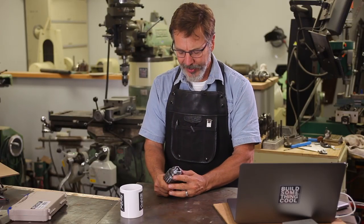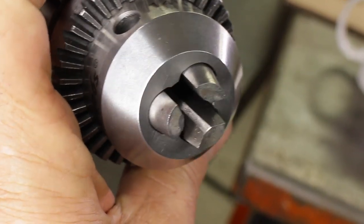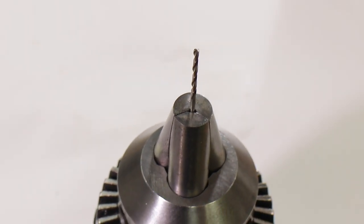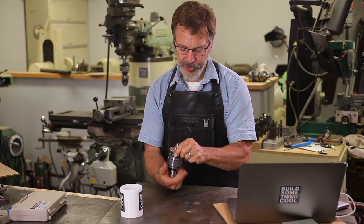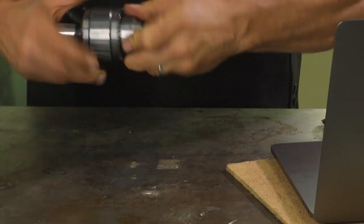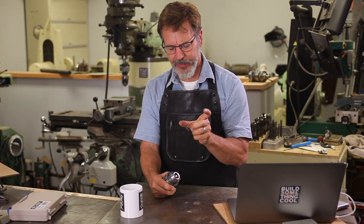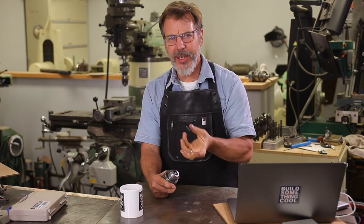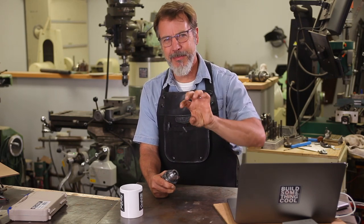What are the disadvantages? The disadvantages are you're going to change the capacity of this — it's not going to be able to hold a small drill bit. But this one I've ground out looks really good; it will clamp down on a sixteenth of an inch drill bit up to a half inch. A lot of you know when you're trying to put a half inch drill in a chuck, they don't always fit. The second disadvantage is you kind of lose the gripping force on these chuck jaws. The shank on a drill bit is really soft, and these jaws are actually designed to clamp in and really get some pressure on it. When you grind them out, you end up adding more surface, and that surface is divided out over a larger area of the drill bit, so they may not hold as tight.